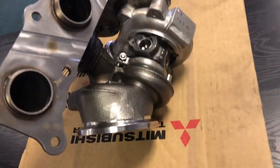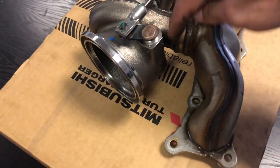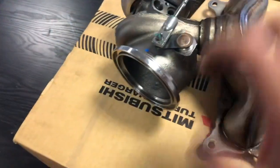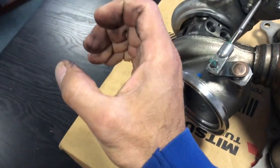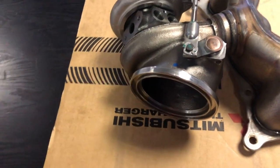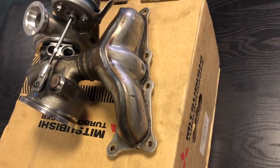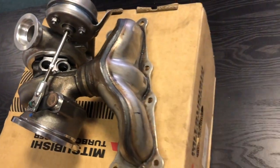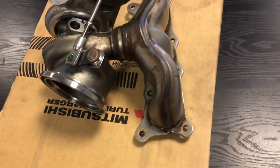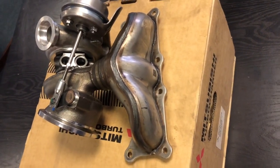The easiest way to do a big upgrade is: take your stock turbocharger, leave the manifold in place, cut off the turbine housing, and from the two manifolds run two-into-one with a little up-pipe with a V-band flange — T25, T3, T4, whatever your choice — and bolt on an EFR turbocharger as a single turbo. This alleviates space in the engine bay and gives you the best of both worlds. Two larger turbos spool slower than one slightly smaller turbo capable of flowing the same horsepower, with less plumbing, less downpipes, less heat, and much simpler overall.